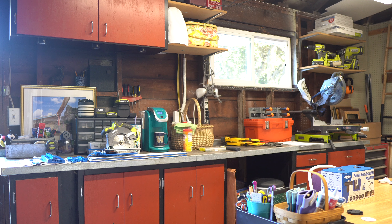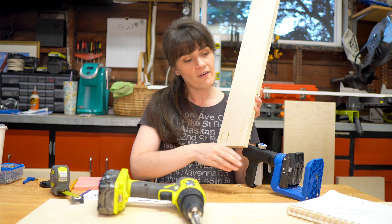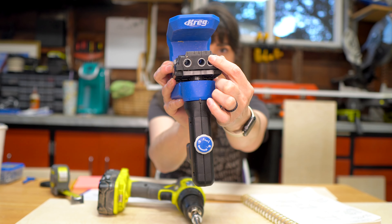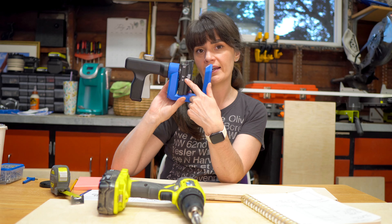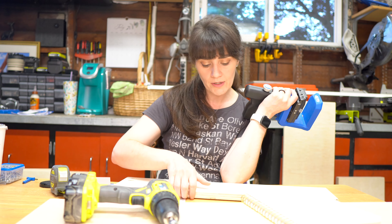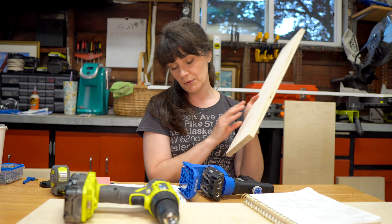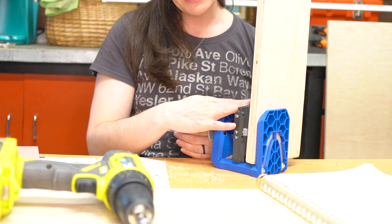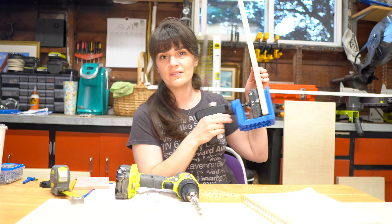I think I'm ready to start putting in the pocket holes. Assembling our custom bathroom cabinet is going to be so simple using our Kreg jig. All you have to do is first measure and mark the center line on your board — after you have a plan for where your pocket holes should go. Line up your center line with the little lines and dots on the jig. I've adjusted the thickness setting on my drill bit. Now I'll put two more on the other side so that it's super strong — put the wood in, line it up, pull the trigger just like a clamp. Make sure this part is flat, and then drill those two holes. Perfect. Easy release. Love that part.